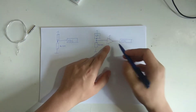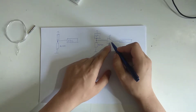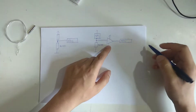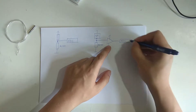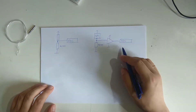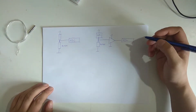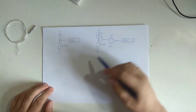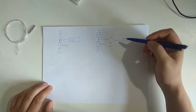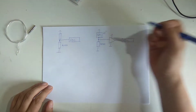The only thing you have to do is amplify this properly. If you've got a lot of drift and noise and you amplify it, then you're not gaining anything by reading this properly with your ADC. So this is the problem we're going to try and solve here. What we're going to do now is go one abstraction level deeper and look at this current source.